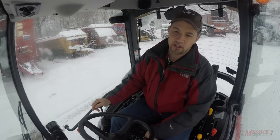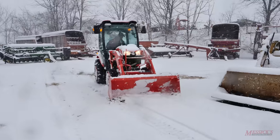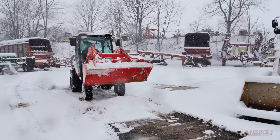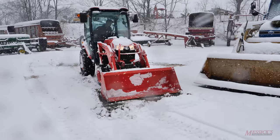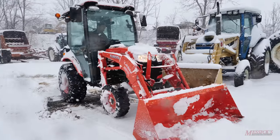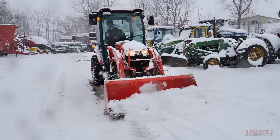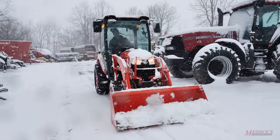I'm going to give you a quick comparison of what this looks like if I do it wrong. If I come up and take my loader bucket and put my cutting edge down, you can see how much dirt and junk I pick up — it looks good because I'm scraping it clean, but look how much dirt and stone I picked up. So when you set your bucket on the stone, you want to set it down on the ground, put it in float, and curl the bucket edge back a little bit just so you get the bucket lip up off the stone. You can feel it — if I take the loader bucket and rock forward a little bit, I can feel the point where I'm starting to catch the stone and get that chattering. If you don't have an indicator, or you're not sure your indicator is set properly, just roll the bucket back a little bit until it stops chattering so much.